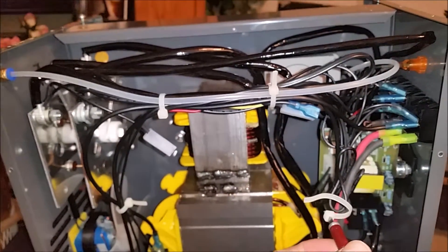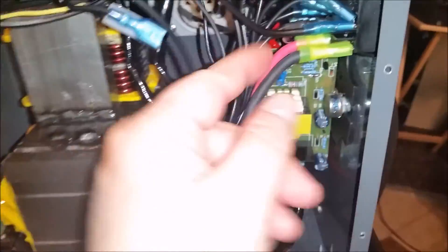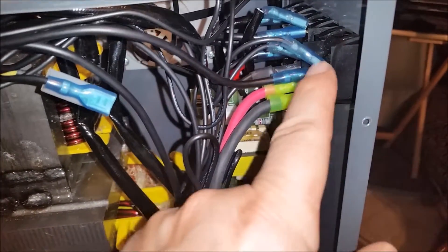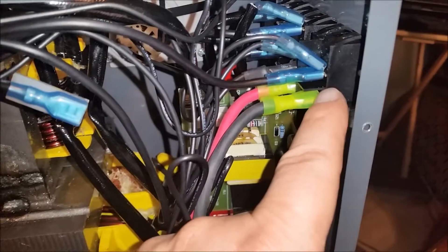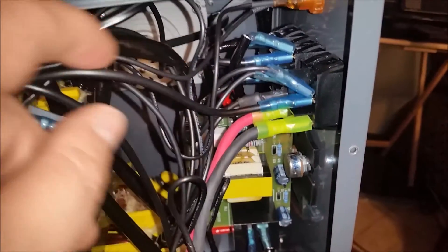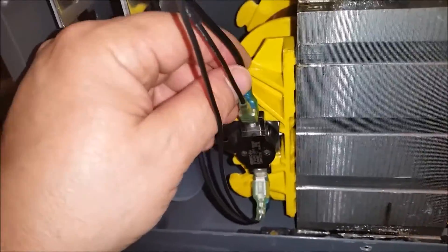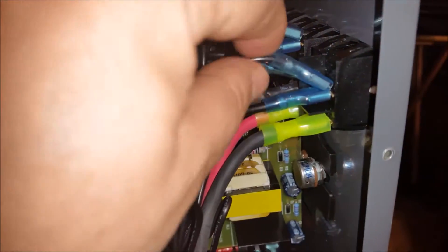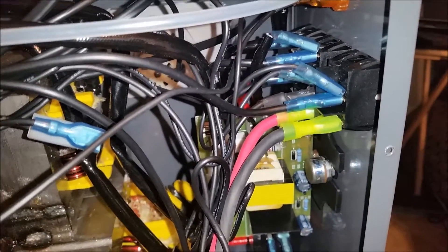I've got all the zip ties taken off. Now we're going to follow where the wires come out of the main power switch — those are the ones we'll change. When you switch the power switch on, it takes power and connects it to these wires. We'll start with this big one here, follow it down, take the pigtails off, build the cable, hook it up, and put the pigtails back on. That'll be it for the L1 phase.